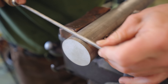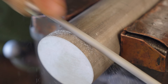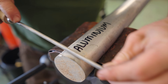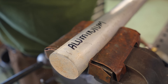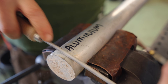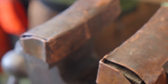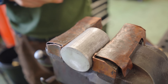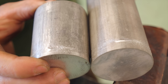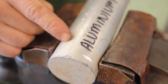Here's the chainsaw file. Plenty soft — made a good little effect there in no time. Let's compare that to aluminium. Aluminium is actually getting bit more by the file; feels like we're taking off more material than on the magnesium. Let's try the other alloy. That feels identical. My verdict on filing is that the two alloys of magnesium are nearly identical — they are both just a little bit harder to cut than the aluminium.